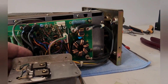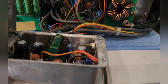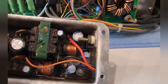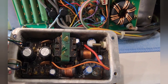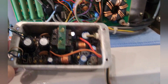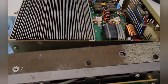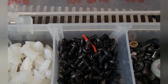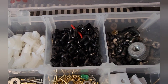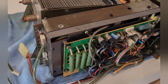From here on, I'm going to tidy up the regulator, fix the wire back on, remove the internal board — which will need me to remove the insulating nut and bolt — and then do a quick reflow and remove those caps and replace them. I've started replacing some of these screws. There were three different screws here, and my mission is to replace all screws. And this also shows me what I need to replace if I leave holes open.